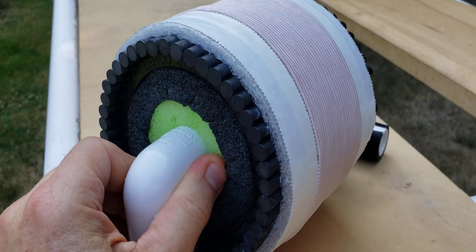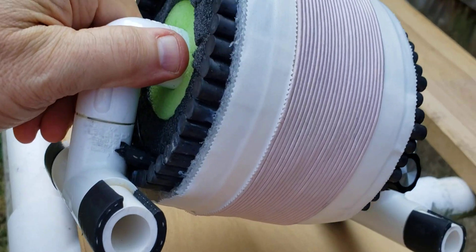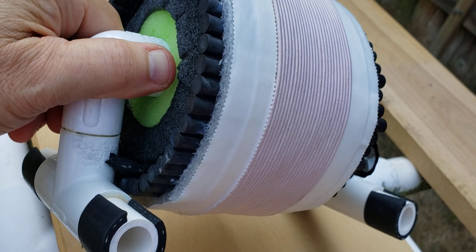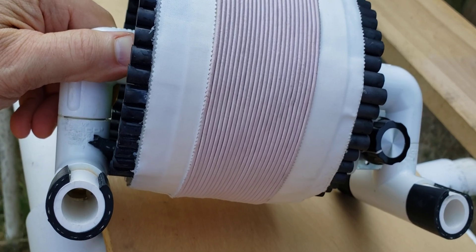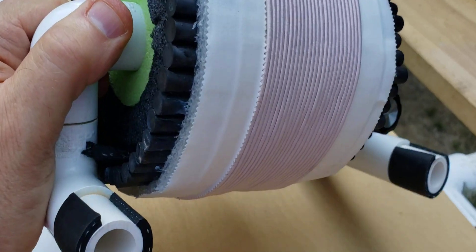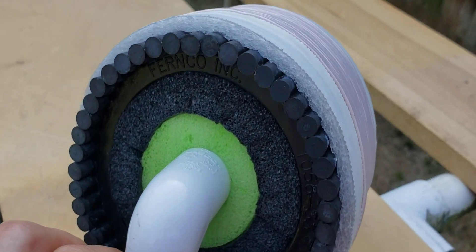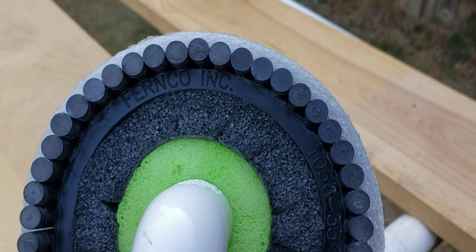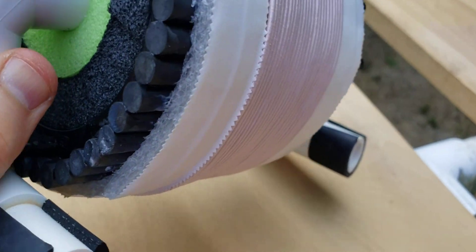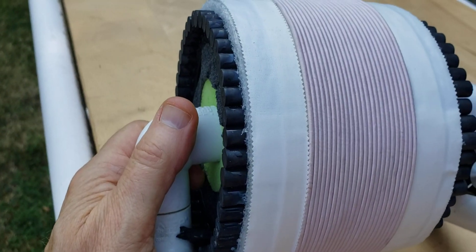If you look at the side here, you will notice that there's a rubber locking tab between the rubber plumbing coupler and the PVC frame. This locks the ferrite sleeve in place so it doesn't slide horizontally. And all of the individual ferrite rods are superglued to the rubber plumbing coupler on this side, which stops them from sliding in and out. So what you essentially have is one solid piece that's not going to shift around on you.